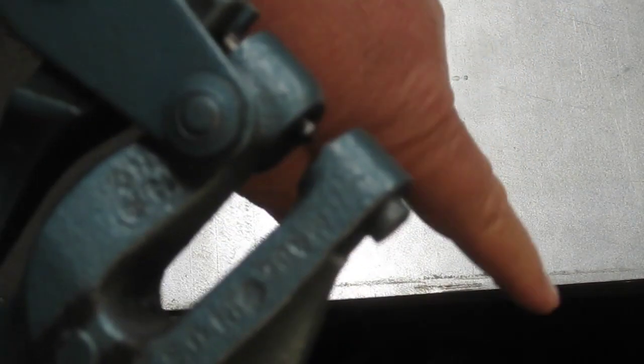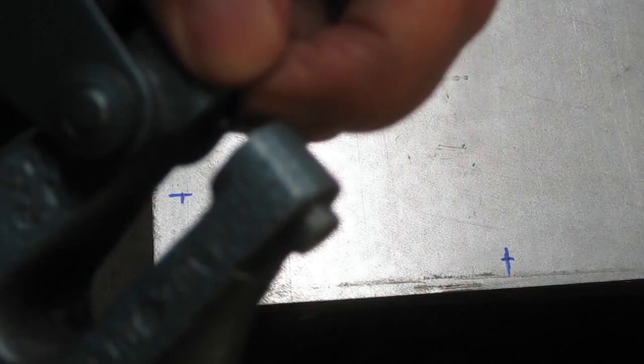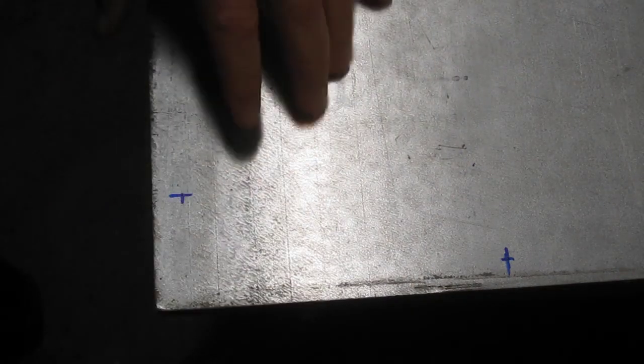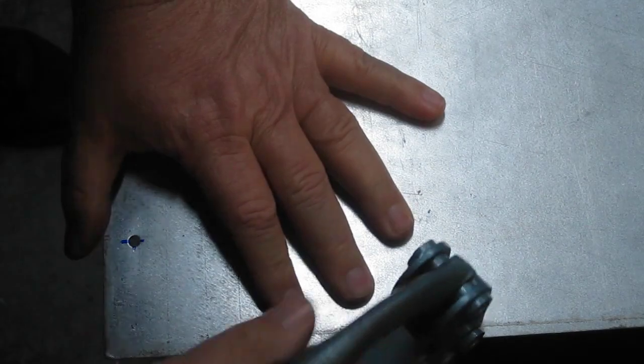So with that little center punch, I use the point to find the center punch. Then I know I'm right on the hole center. You kind of just drag it along until I feel it drop into the hole from the center punch. Boom. And then we do it over here on this one. There we go. And there we go. So now I have my holes pre-drilled.